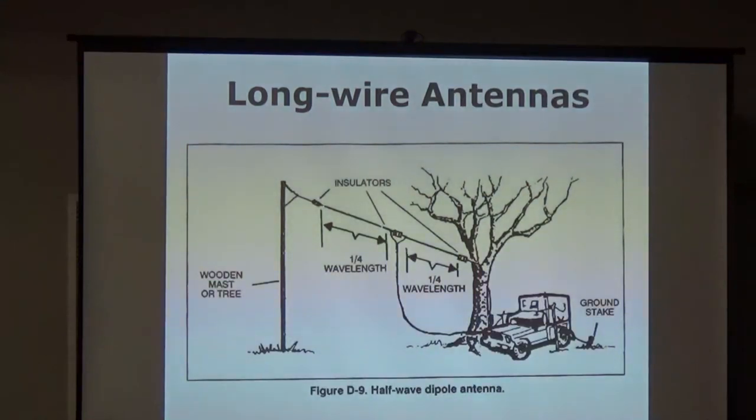You'll want to rig the ends, or at least one end, on some sort of a system that lets you raise and lower the antenna, because you're going to fiddle around with tuning this thing for a while and need to do some trimming. If you're using a tree or two, there are any number of ways to get those support ropes up in the upper reaches of the trees. None of them involves imagining that you can climb trees. You hearing me? None of them require that. You leave that to the cats and to the people who get paid to do that sort of thing.